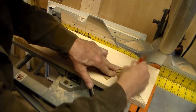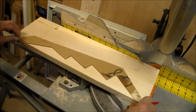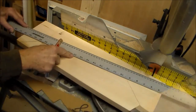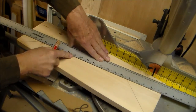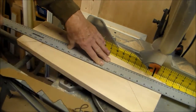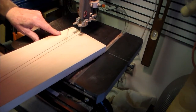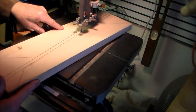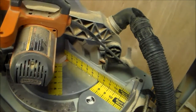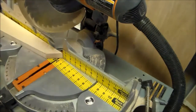I'm tracing my pattern onto a one-inch piece of birch wood, and you will need a dark piece also in order to create the dark-light pattern of a picture. Here I'm drawing a cut line and squaring off my line of my pattern, and this will be the line that I will follow with the bandsaw. Both ends I'm cutting at a 45 degree angle with my chop saw, and this gives me a real smooth cut in comparison to what the bandsaw would do.